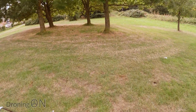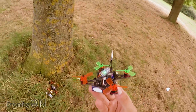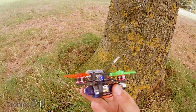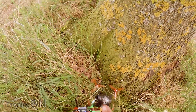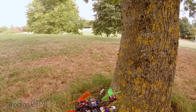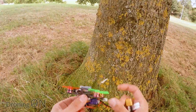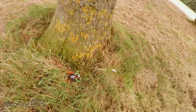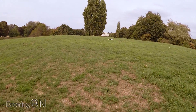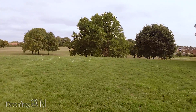As soon as you connect power to the drone — as long as it's got a 5 volt power supply, they said it can support up to 8 volts but nothing more — that arms the little finder and you can see the little green light on it. With it armed, as soon as you unplug the battery it sets it into a quiet beeping mode where it will beep for 30 seconds at very low volume. After 30 seconds it hits its full maximum volume. The reason it does that is so you don't deafen yourself when you're simply changing the battery. If you were to put a brand new battery on, it would go silent again and basically disarm itself.